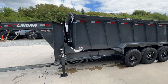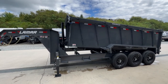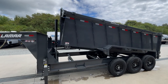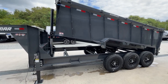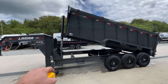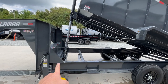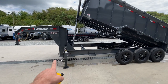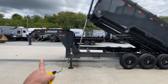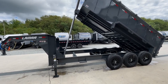This is in first stage — first stage is going to be a little bit slower. There's not much on a telescopic you won't be able to get started because of the efficiency. Notice it's going vertical — there's no redirection of force. It just hit the second stage there, which is going to speed up a little. On a telescopic you've got a pretty tight operating range of pressure. You might start at 2,000 PSI, then as it gets going it'll drop back to 1,600. Second stage takes it back to 2,000, then I just heard it hit third stage — it's going to get quicker.